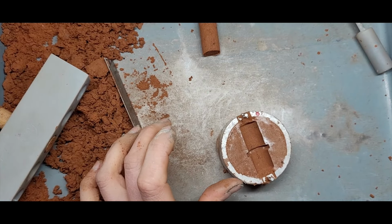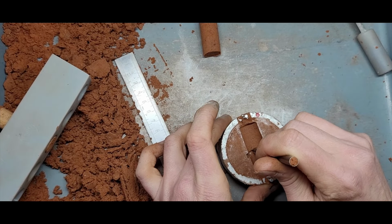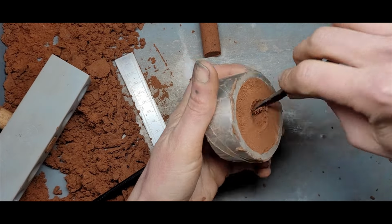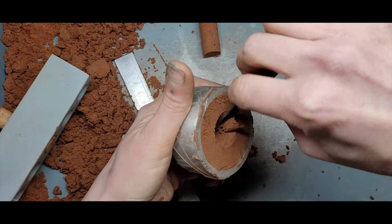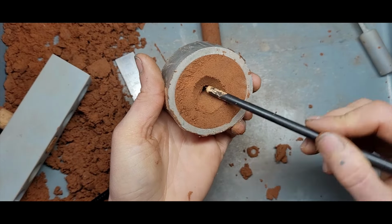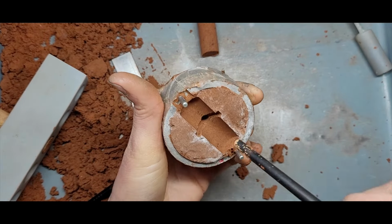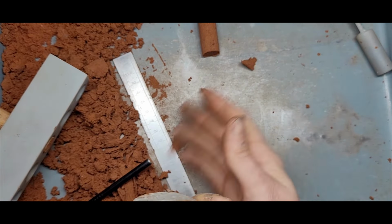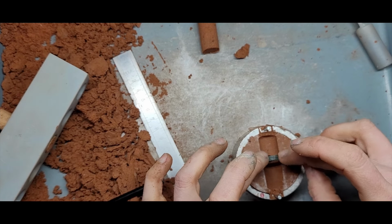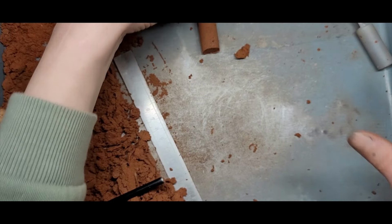Let's do our sprue and funnel. Where's my straw? There it is. So straight through the shank. Whoop. All the way through. Let's carve that funnel. Let's clean that hole out. Make sure there's no loose bits of clay, that funnel is really nice and smooth. Cool, cool, cool. Just going to get that ring shank and just press it in gently just to crispify everything back there again. Wonderful. All right, I'll set that to the side.